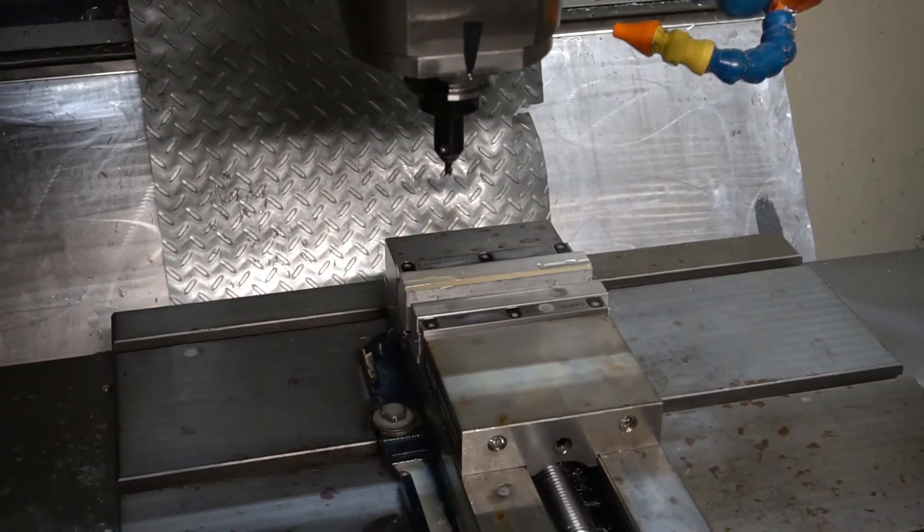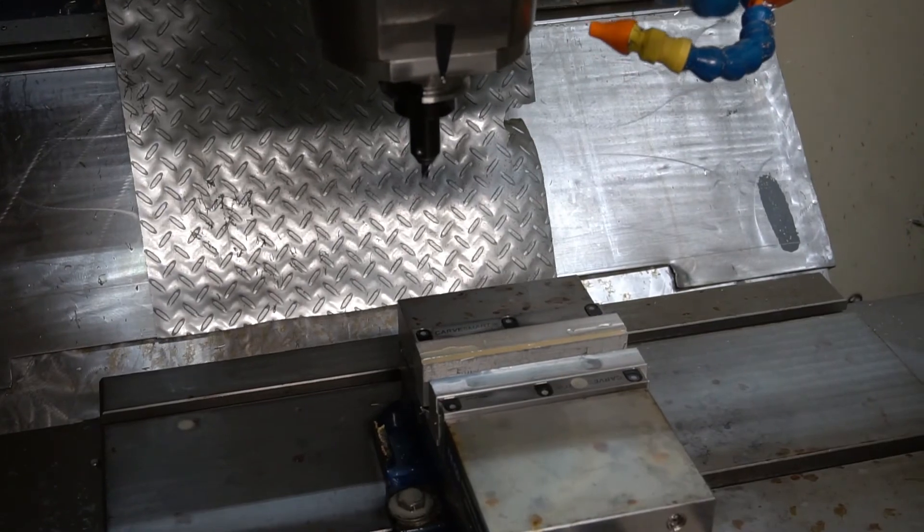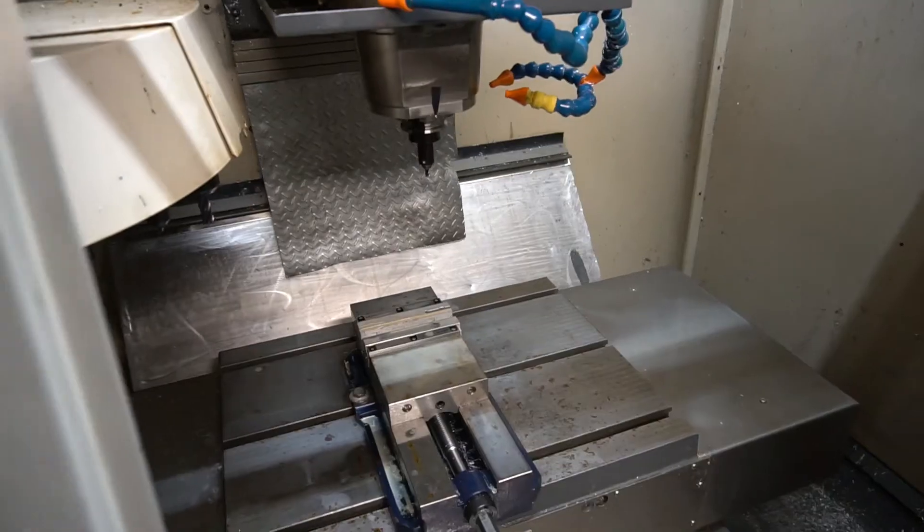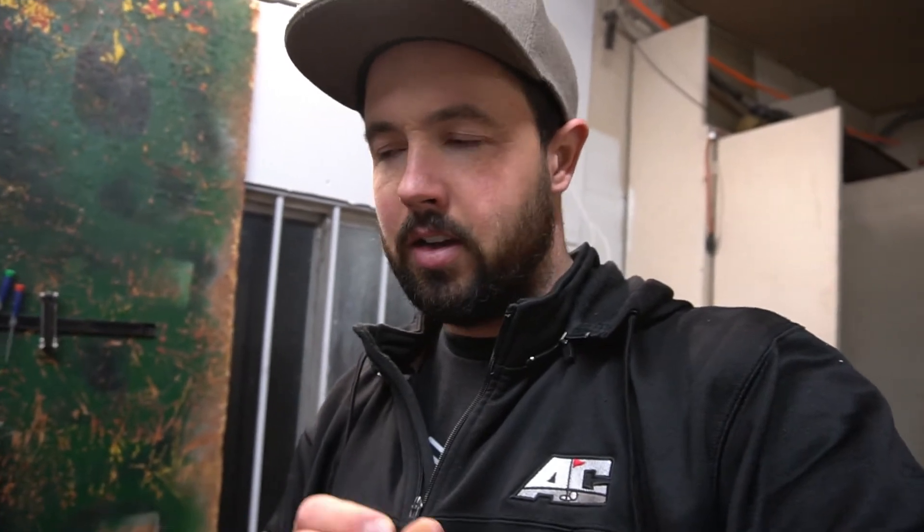Let's see what 400 inches a minute does. So we shaved about 5 seconds off that program — kind of weird, seems like it should be more. I'm going to have to look at what's going on, but I think part of that is that we might not be getting that full 400 inches a minute. It might be taking a little bit to get up to acceleration — it's kind of accelerating slowly. I'm going to turn the acceleration up a little bit to see if I can get it moving a little more briskly off the get-go.